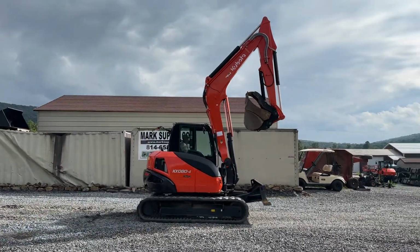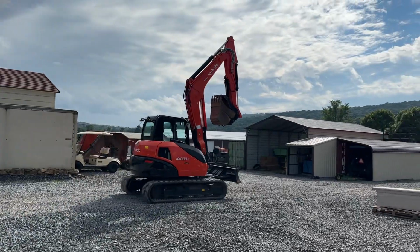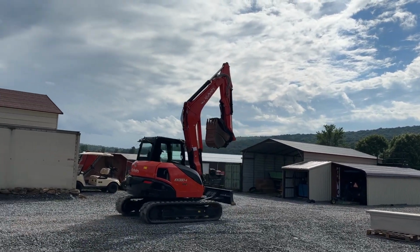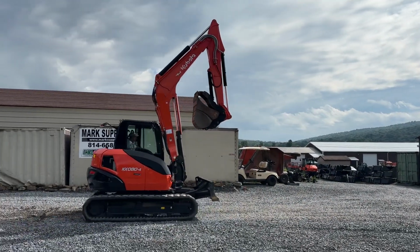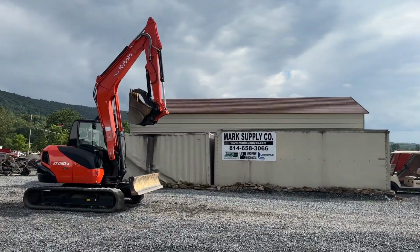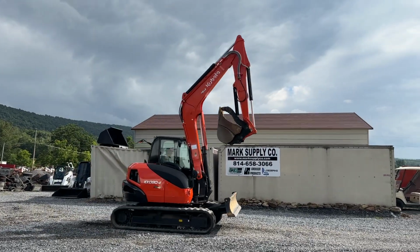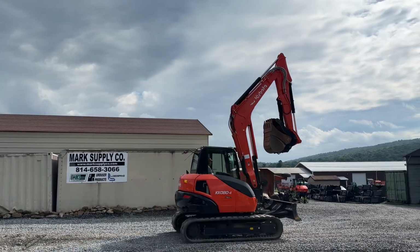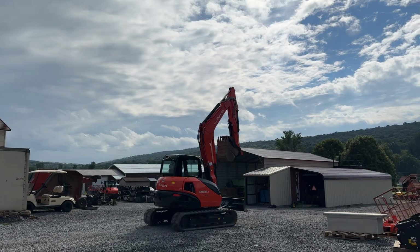You take a Bobcat that's 3 years old, and has 600 or 800 hours on it, and you will be repacking some cylinders, okay? You'll see a Kubota excavator with 3,000 hours on it, and a cylinder's never been touched yet. It is just absolutely amazing, the attention to their manufacturing. I really believe it has to do a lot with their quality and their quality assurance and their tight tolerance of spec. Same with their engines.